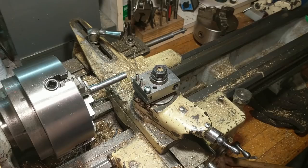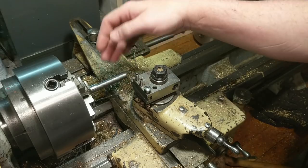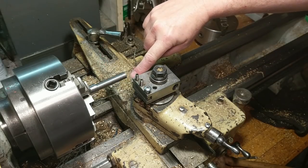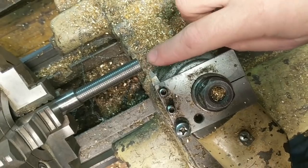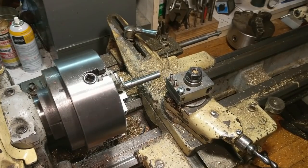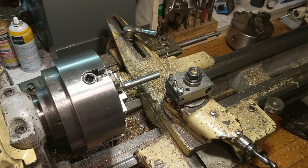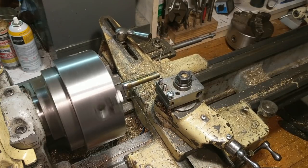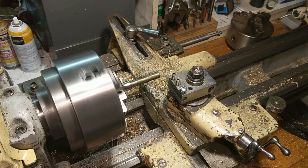I have the majority of the material removed in the half nut, but I'm not getting a clean fit with the lead screw — I'm not really sure what direction I don't have right. So in order to get it right, I've decided to make a tap. This is water-hardening steel, turned down to exactly the same dimension. I ground a high-speed steel tool bit to the form of an ACME thread — 29 degrees with the proper dimension across the tip — and I'm now cutting the threads as though I were cutting an ACME lead screw. When it's done, I'll cut the longitudinal slots, taper it, and harden it.